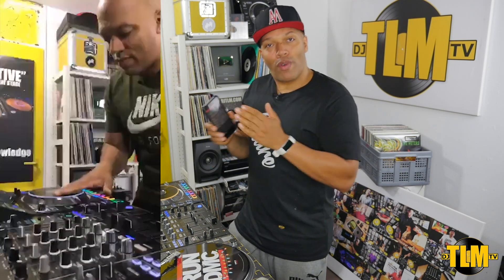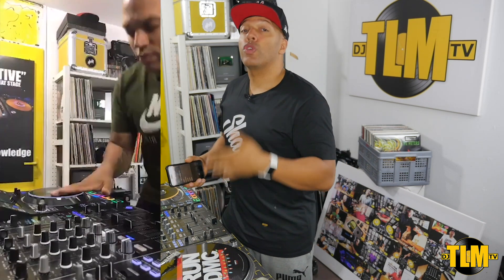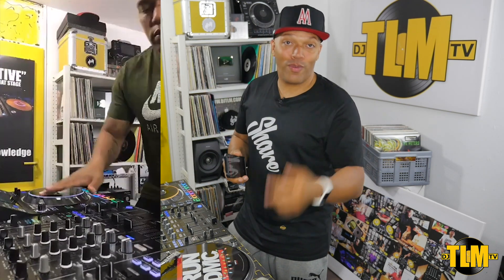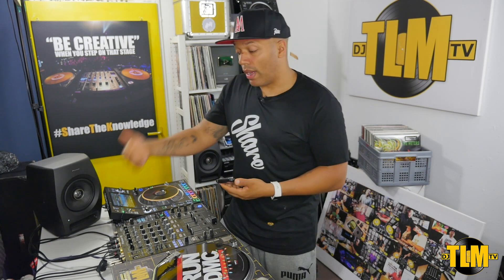Now I've already tested this, and you've got to keep one thing in mind: if you're used to talking and mixing, you cannot do that by just talking in the room, because the microphone on the phone is not working. I tested this on Facebook Live and I started to talk to the people — I could tell straight away they were probably not hearing me. I asked them, can you hear me? No. Then I started the music and asked them, can you hear the music? And they could hear the music just fine. So it is only getting audio from the mixer — either you have to connect a microphone to your mixer or just not talk. I would definitely prefer to have that good quality audio for my stream, straight from the mixer instead of getting the sound from the room — it's just never the same, it's going to be a lot clearer, and that's going to enhance your live stream.